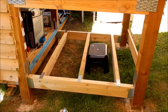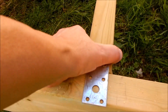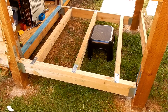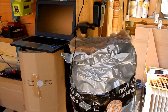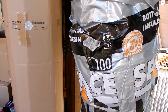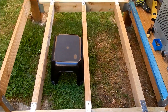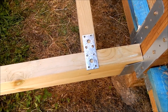I've done three of the two-by-four cross beams. The centre one is screwed in place; these outer two are loose at the moment while I decide on spacing. I've opted for 400mm centres because this roll of fibreglass insulation is pre-cut into 400s and 200s, and that worked out pretty well for fitting between the gaps.